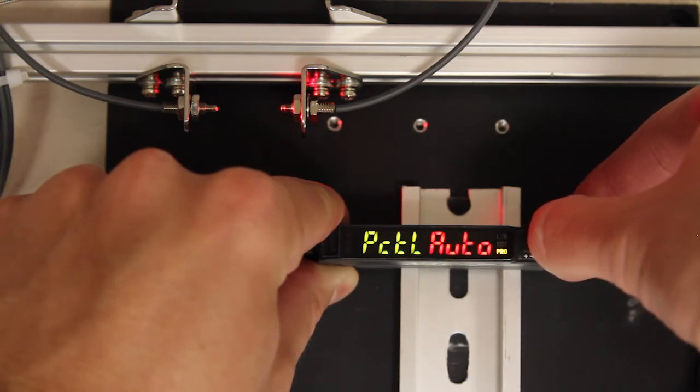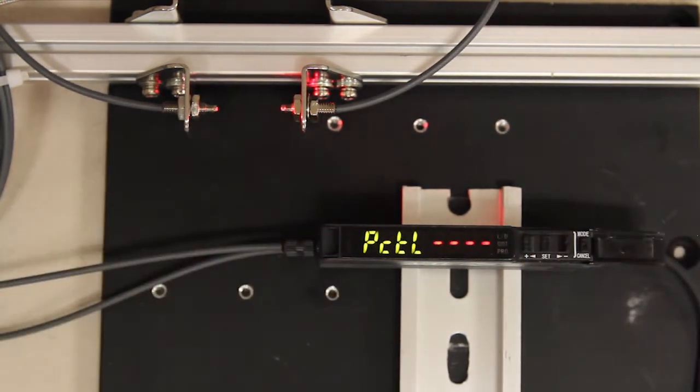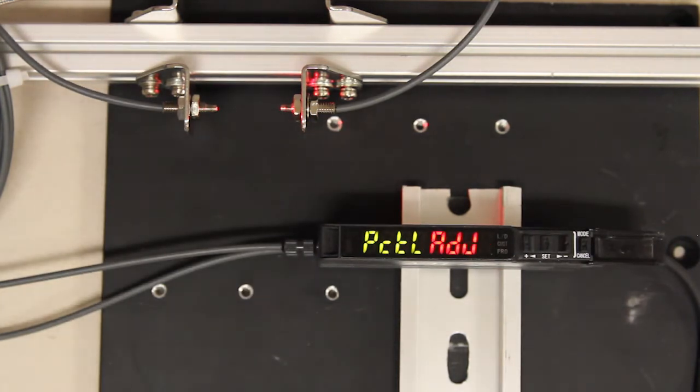So when I click this and then set it, the sensor is going to monitor the situation that it has in hand. It's going to see how much light is being received and determine whether or not it's too much. If it's saturated, it starts backing off on the LED intensity until it gets to a point where it can detect again.